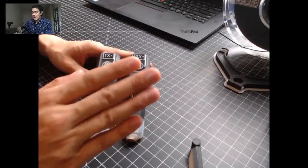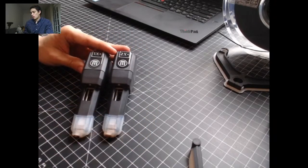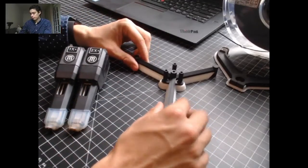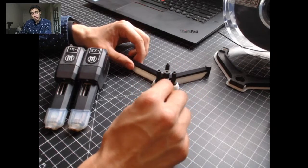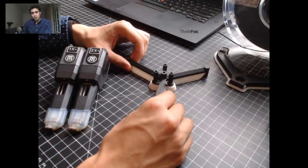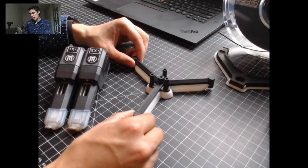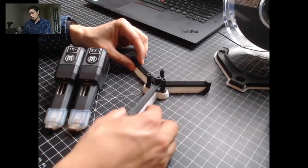support with. And in the case of ABS, we are working with a particular type of support, and here it's one of my print samples, called SR-30. SR-30 is a proprietary filament from Stratasys, that's our partner company, that will allow you to dissolve the supports after it's been printed out, right? So as you can see here, the black component of my part, that's my part, right? And the white one is the supports.